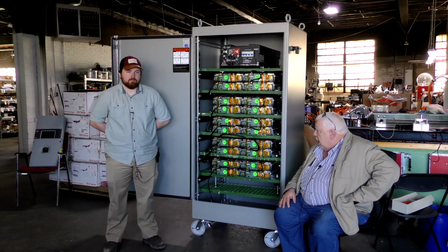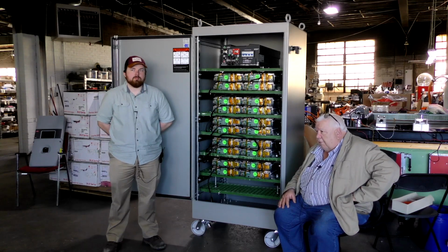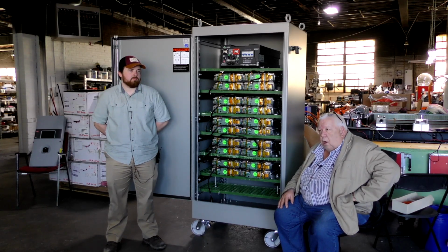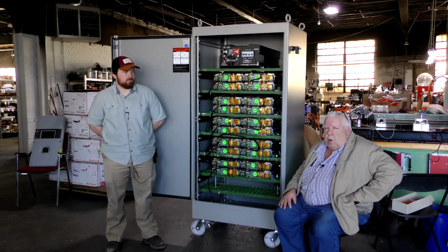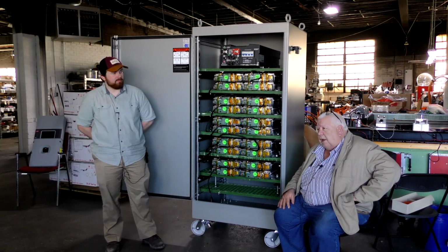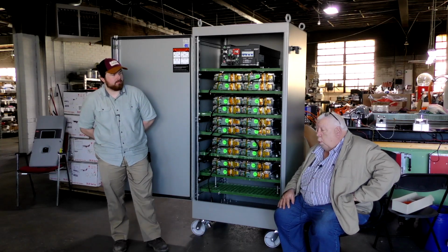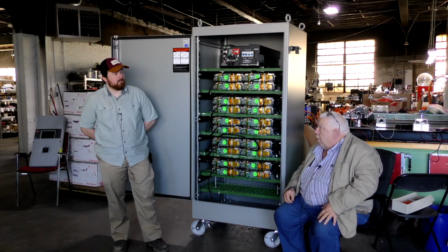They are doing something kind of neat right now that I approve of. Several companies, Panasonic most notably, but also Solaria and SunPower, were all, by the end of March, shipping what they're calling AC modules. At about $495, Solaria has a 345 watt panel with a microinverter, a grid adaptive inverter, already assembled and mounted on the back of the panel.